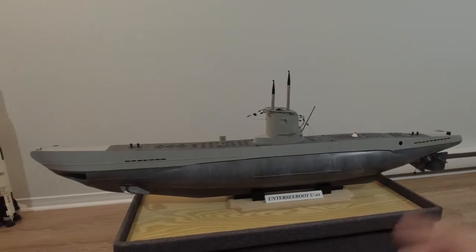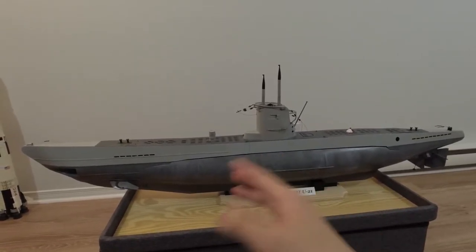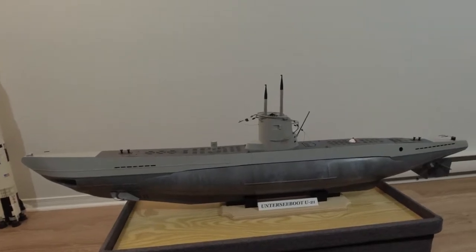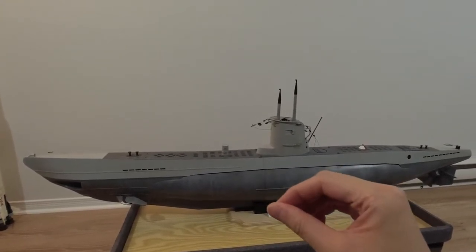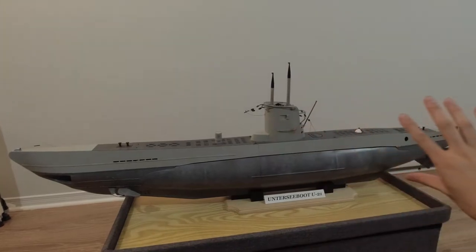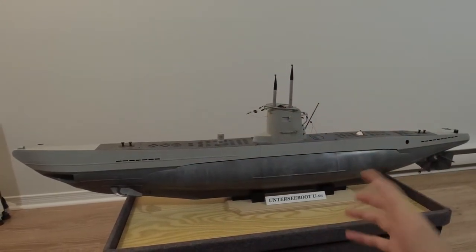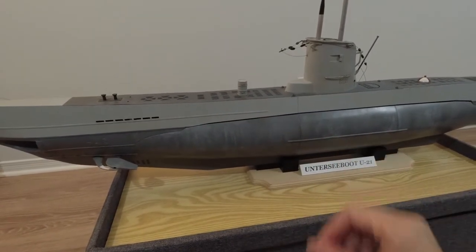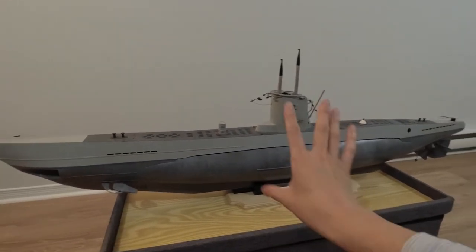From the pictures that just flashed by, you've probably seen that rather than doing a more classical way of building RC submarines — creating a fiberglass hull from silicone molds or using a foam master model — I've gone the completely opposite way. I've employed the more traditional model boat building technique where I've actually skinned this boat over a styrene frame, building up the shape section by section. The styrene I used is a pretty thick variety, and so far the hull is rock solid.